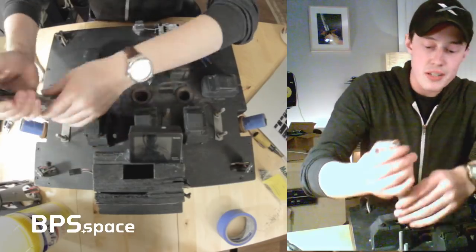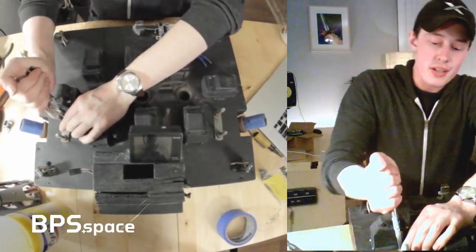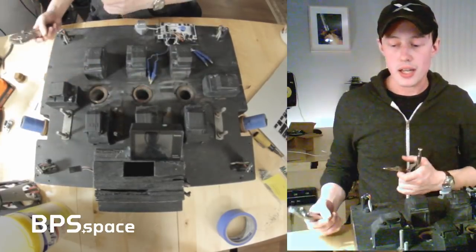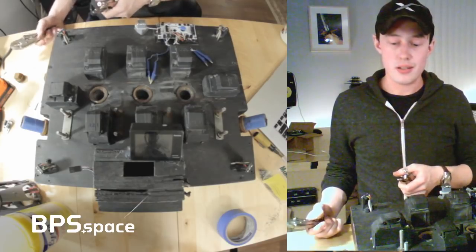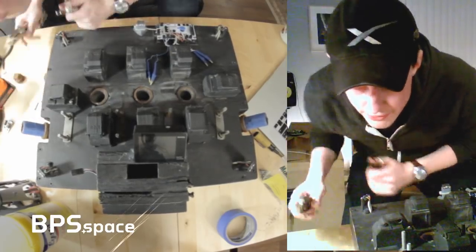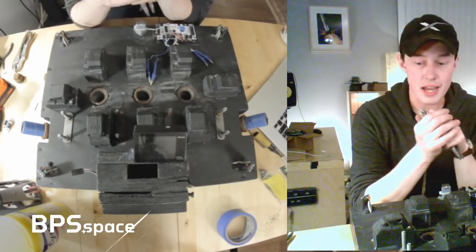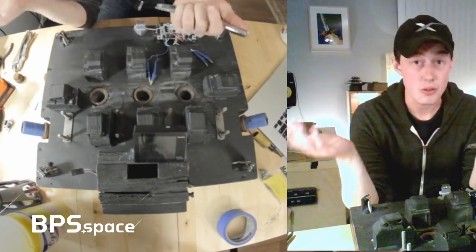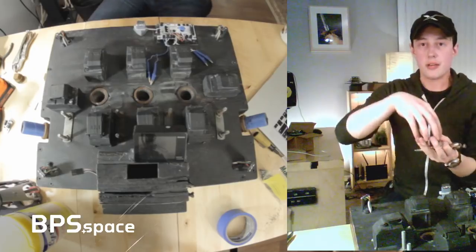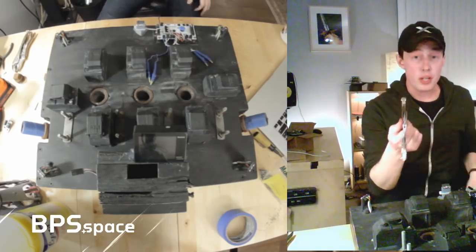The thing that seems to be a constant in rocketry and in any type of control systems engineering is that any time you can make whatever you are trying to control a rigid body, any time you can avoid multi-body dynamics is a good thing. With the Falcon 9, I don't actually know what the control software looks like, but almost certainly any orbital vehicle has to have compensation for how the vehicle flexes in flight. The bottom of the vehicle and the top of the vehicle are so far apart that they will have slightly different orientations.